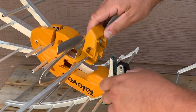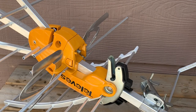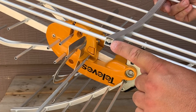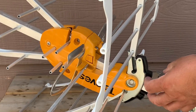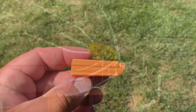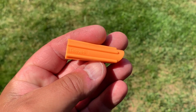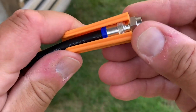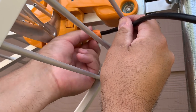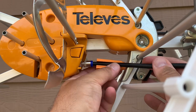There's a square notch on the active element so it only goes on one way — seat it on the main boom and press it into place until it snaps in. Now add the final UHF reflector: make sure the unfinished side is seated against the antenna body, lift up the cam, slide it in, and snap it closed. There's a handy hexagonal finger wrench tool included that slides over the coax cable fitting, making it easier to connect the coax cable to the active element despite the tight squeeze with the bottom UHF reflector.